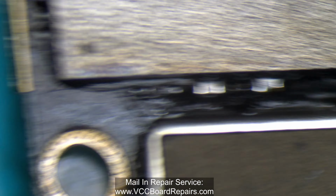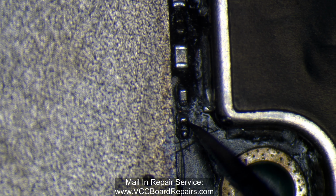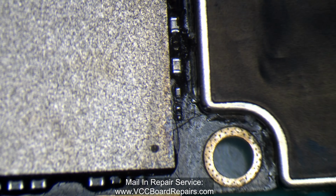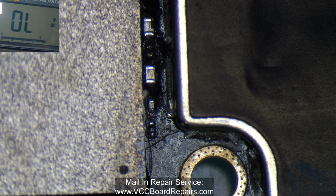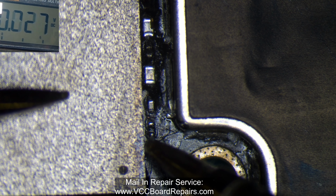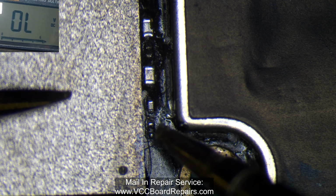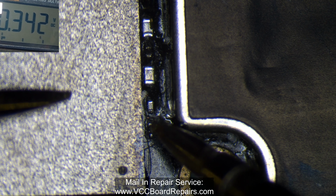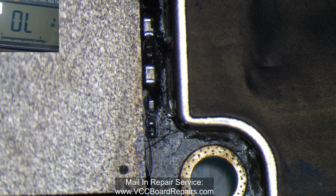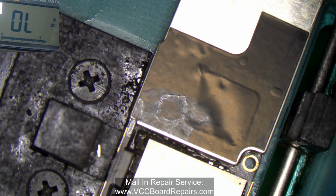So I got that installed. Now the poke test. Yeah, I'm poking it and it feels solid. We could also do a diode mode test. So essentially we're gonna just measure, oops, my probe slipped. So 261, 242. So yeah, I mean, it's not shorted and we get readings. So that means there's some connection somewhere. So I think we're good.